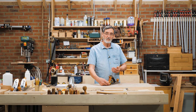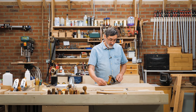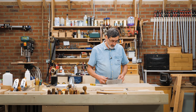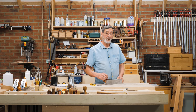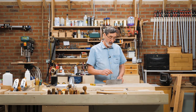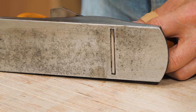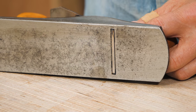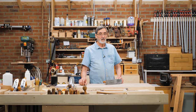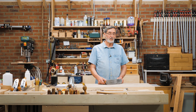This stops the shavings from rising up too far ahead of the cutting iron cutting — that's why it's there, that's what it's for. You cannot take that frog way back and alter the distance between the cutting edge and the fore part of the sole; it won't go any further back. It's a great thing to know because then you won't be deceived into thinking you can have this extra wide adjustment. You can't.